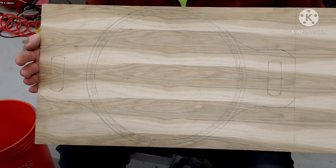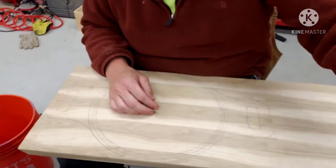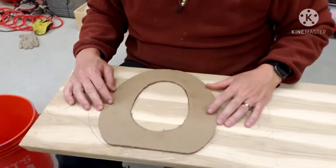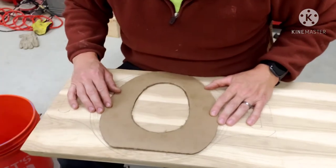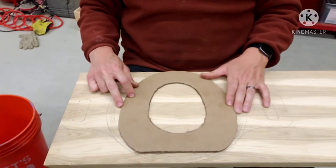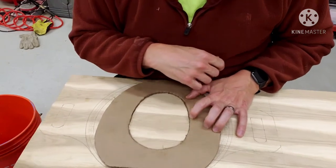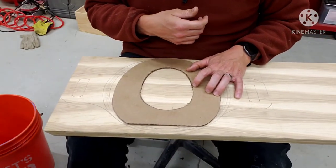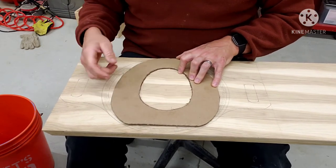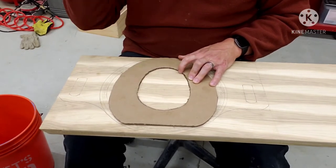That's about the design I got. The only thing I really still have to lay in is where the opening is going to be in the center. This is where the cardboard copy that I made of their little port-a-pot seat comes in handy. We'll lay this on here — I'm just going to kind of eyeball this side to side — and then mark this center cutout, and then it'll be time to get the jigsaw. Obviously if you've got a bandsaw it'd probably be way easier; that's one tool I still do not have — it's on the list. But for now I'll be jigsawing this out after I drill some holes.